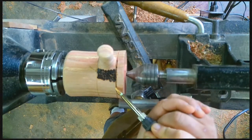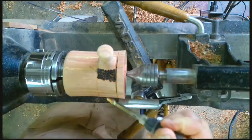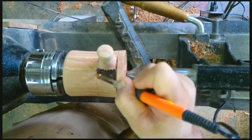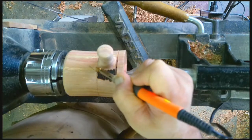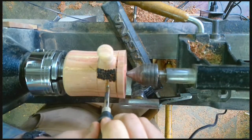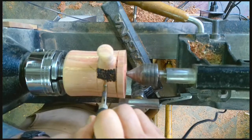I prefer to use a wood chip and you do a friction burn that way. But even a wood chip wouldn't be really smart with this handle spinning around. And you've got to get your RPMs up fairly high, at least in the 800 or 900 range, in order to generate enough heat. And again, getting your fingers that close with a wood chip or getting a wire that close is just not smart. It's a guaranteed way to have a bad day.